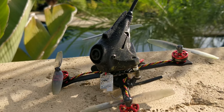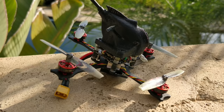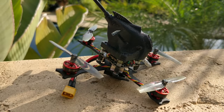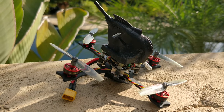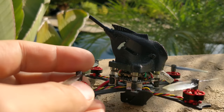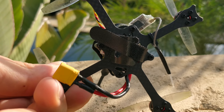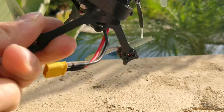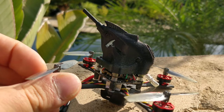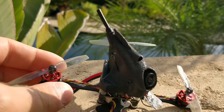So this thing — I have no idea what it's called — and it looks like it's inspired by Mass Effect because this thing on top looks like a character. So this is the NamelessRC, it's a toothpick or toothpick class quad. It's using the NamelessRC regular all-in-one board, not the actual toothpick board, which is interesting because they made this after they made the toothpick board. I don't know why they went with the regular all-in-one board — maybe they just had a surplus of them — and then they stuck the Caddx in there with their 400mW VTX, the Caddx split camera.